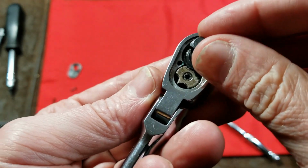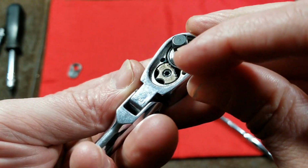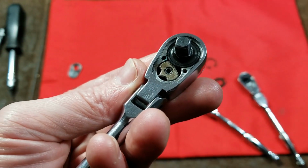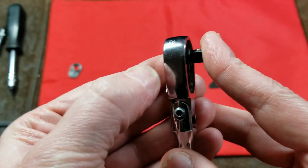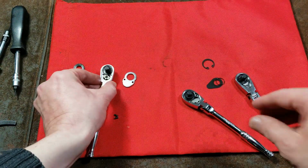Half of ratchets that do slip wouldn't slip if they had really nice precision and then pretty strong springs to really drive those pawls into their teeth. People didn't like the switches on these because these are pretty hard to flip just with your thumb. You really need to use a fingernail, but they do engage quite reliably.